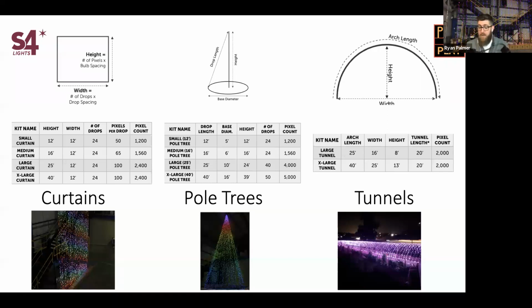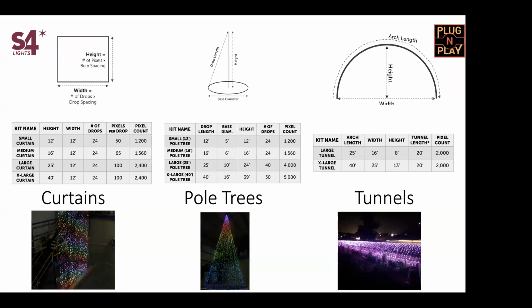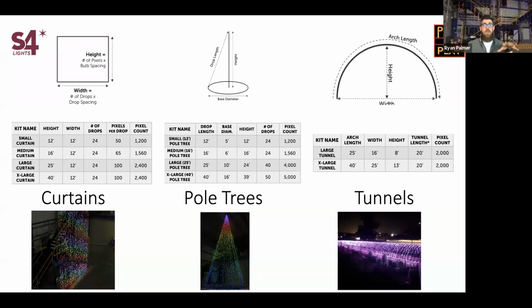Perfect. If you say, well, I want to do what's behind you, I want to do 12-inch spacing, cool. All you're looking at is the exact same 25-foot light strings, but instead of a mother line at 6-inch spacing, we gave you an individual tap. Now that has 12-inch spacing, or if you want to use the full extent of the 12-inch tail and the 6-inch lead here, you could have up to 18-inch spacing. So we allow you to scale that install from 6 inches all the way up to 18 if you so choose. It's all about the area that you're trying to cover.